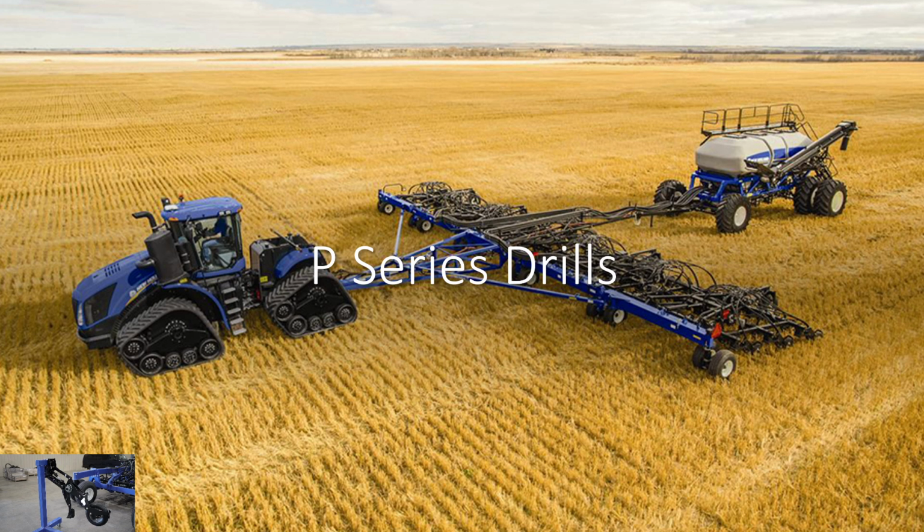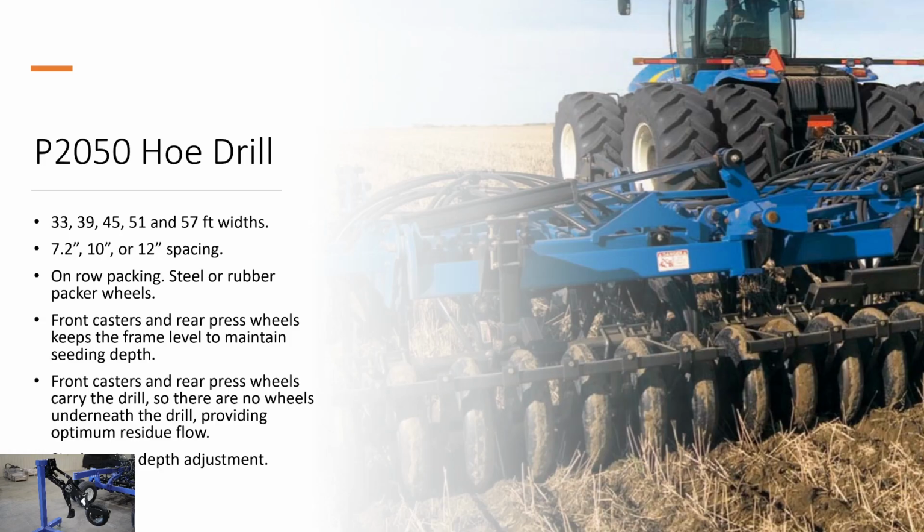So let's go into the P-Series drills. First drill we're going to cover is the P2050, which is available in the 33, 39, 45, 51, and 57 foot widths. Available with 7.2 inch, 10 inch, and 12 inch spacing. On-row packing, steel or rubber packer wheels. The front caster wheels and rear press wheels keep the frame level to maintain seeding depth. The front caster wheels and the rear press wheels will carry the drill, so there are no wheels underneath the drill, which allows for optimum residue flow and trash flow underneath the drill. And there is a single point depth adjustment on the 2050 as well.